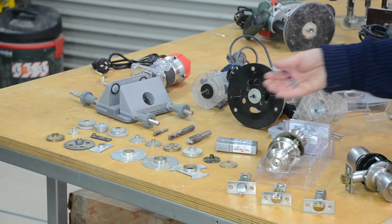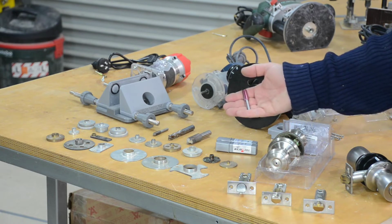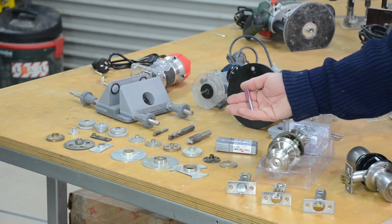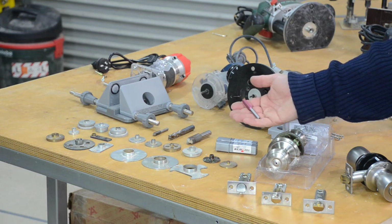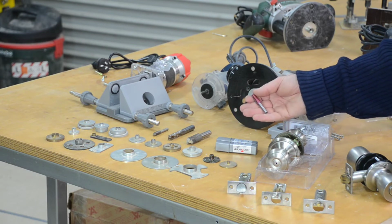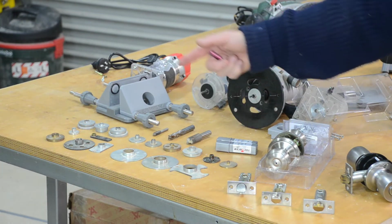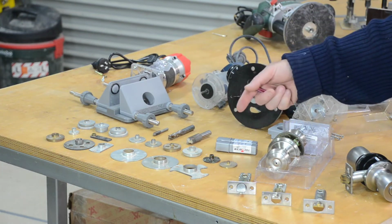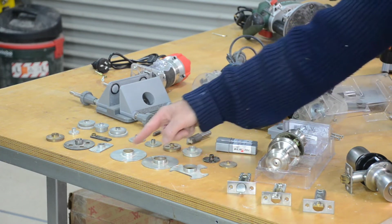For argument's sake, this is 10mm. So if you wanted to tweak that a little bit and there's no 9.5mm, you could go for 3/8, which is near enough 9.5mm. So you get pretty high incrementation with the cutter resolution by switching between metric and imperial. As you can see with all these template guides, they are all for different routers, with the exception of these three. They are for one router.